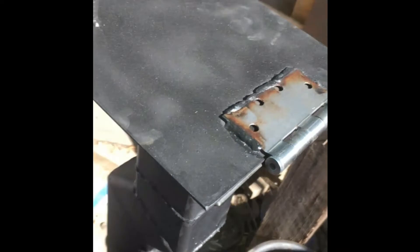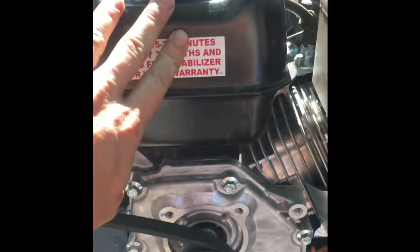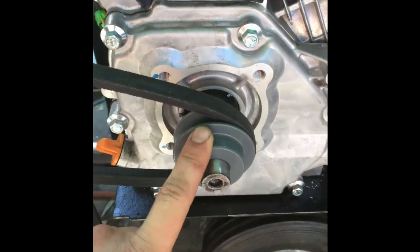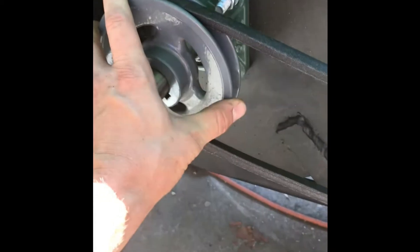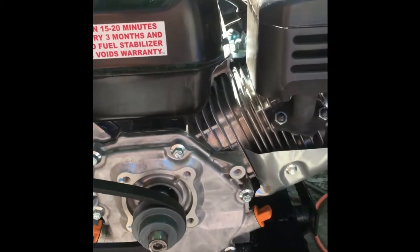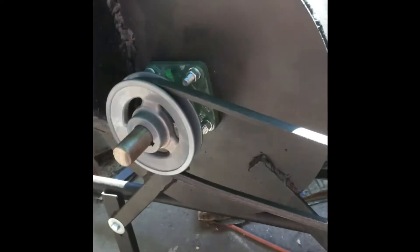The old dolly didn't have good tires, so I replaced them using the cotter pin method — the washers aren't great but it works. This is four inch diameter square pipe. We put a cap on it because the bend isn't absolutely perfect, and when this thing flings material up it might come all the way out the top. Then we've got a Harbor Freight 212cc, 6.5 horsepower motor — $99 on a good day with coupons. I've got a 2.5 inch diameter drive pulley going down to a 5 inch driven pulley, which reduces the RPMs by about half. The motor's rated RPM at idle is 1,725, so that reduces it down to roughly upper 800s RPM.